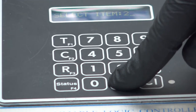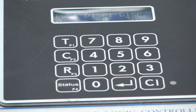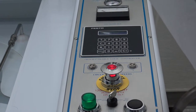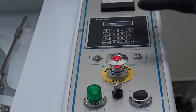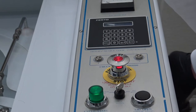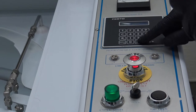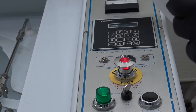Now we're going to go through the various items we can individually actuate in manual mode. We're also providing an addendum to our manual because the original manual had the proper physical configurations but not the same programming for the Festo. The addendum shows the current inputs and outputs on this system. To demonstrate: number three is the blower — the internal blower just turned on. Number five is the heat lamp — you can see the heat lamp has just turned on. Number seven is the brush — I can hear the brush rotating.